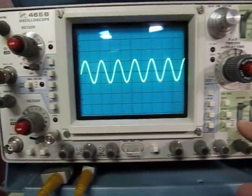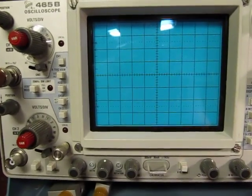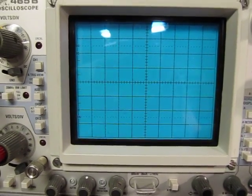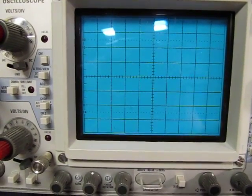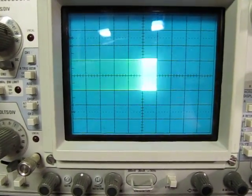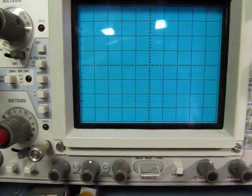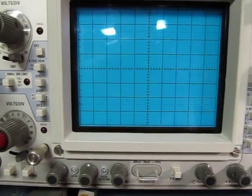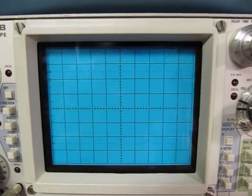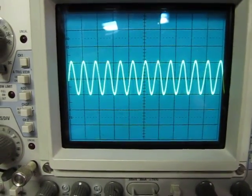A way to think about it: I'll throw this into a slow sweep and a single sweep mode. The trigger basically says I'm going to kick off the sweep now. I'm doing a quick single sweep to show that I'm kicking off the sweep at a certain point in time. Triggering is normally done by looking at a portion of the input signal and telling the sweep to go across at the same point in time in a repetitive signal.